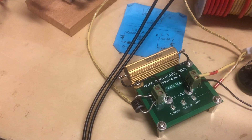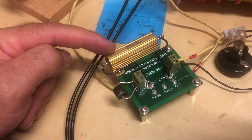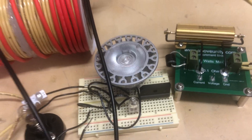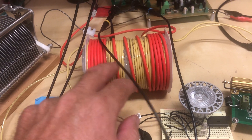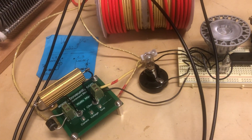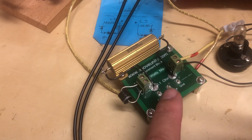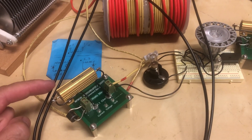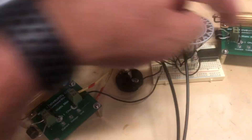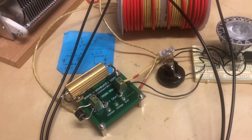Now I don't have to worry about the 5-watt max on the old measurement block anymore - I've got a 50-watt 1-ohm resistor. I've changed all my measurement blocks, with one on each side, because I want to make sure the impedance between L2 and L3 are the same. The reason Chris uses a 0.1-ohm resistor is so it doesn't really affect the circuit - having the 1-ohm does affect the circuit - but I'm trying to keep the impedance the same between the two output coils.